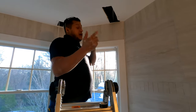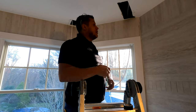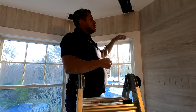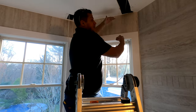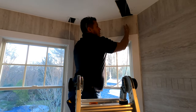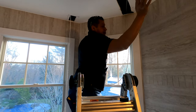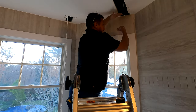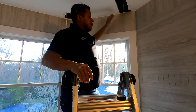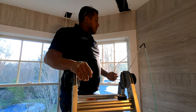Getting the wire to this location I would consider less difficult — maybe more time consuming. It depends what window you're dealing with. Typically, windows just have wood above them with a wooden frame. Sometimes there's a big fat header. What builders and framers do is put a piece of beam here, then stack it with double or triple stack studs on the side. Sometimes you're going to have a beam here or a chunk of a beam; a lot of times you'll have double stacks here, single or double stacks up above. That's how you drill through the window.